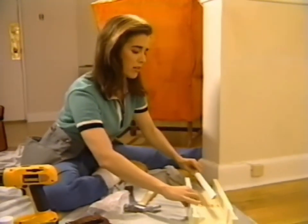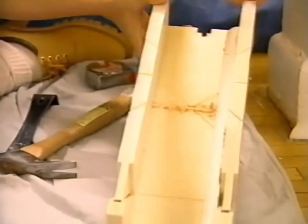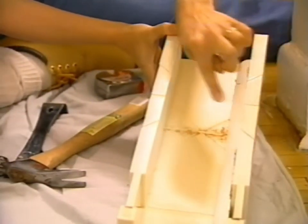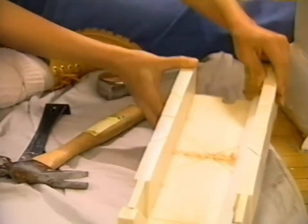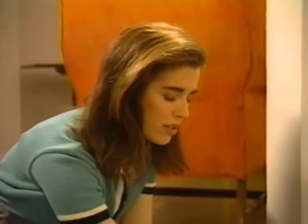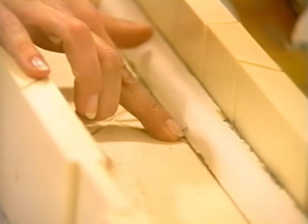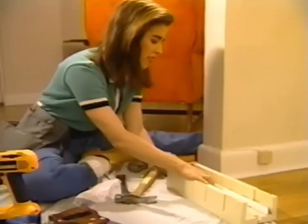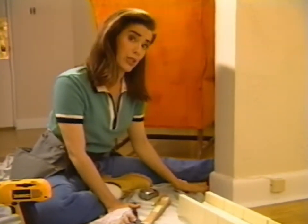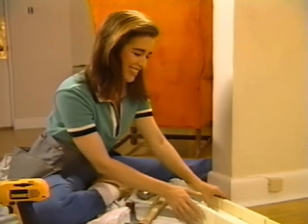So I put it in the miter box and there's the angle that I need. You can see on the miter box the 45-degree angles are here, and then there's a 90 right through the middle if you happen to need to cut a 90. I'm going to line it up. The inside mark is there. My outside mark is falling a little bit outside, which tells me either the far angle is a little funky — perhaps the carpenter who did it didn't quite cut a 45-degree angle — or something else. You can really only experiment.